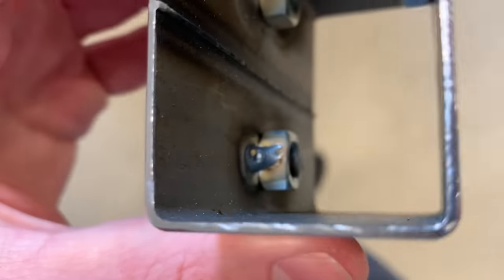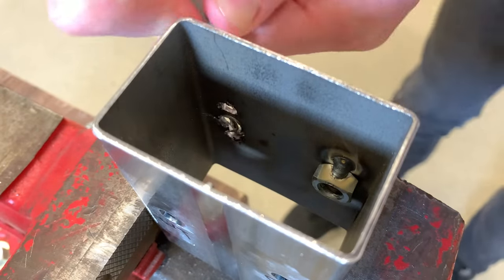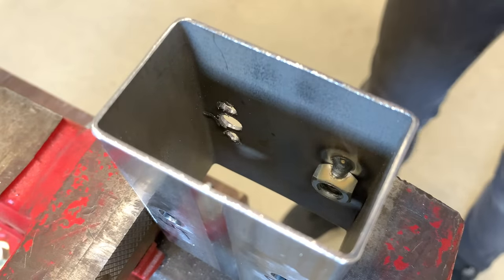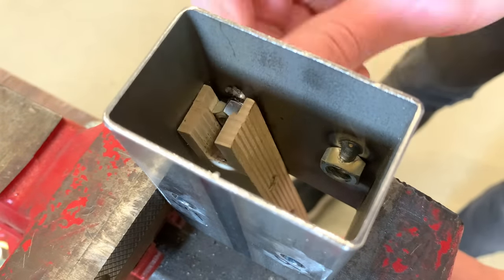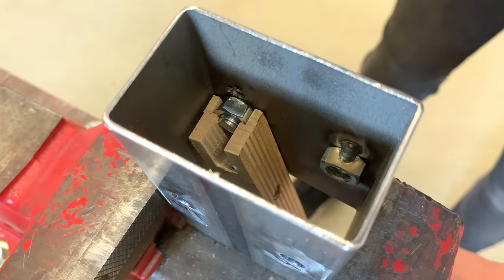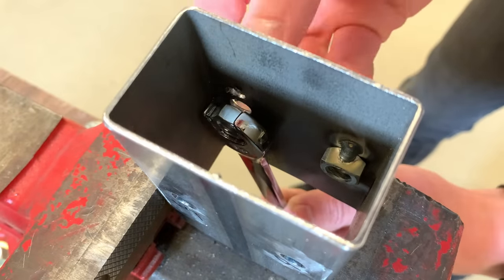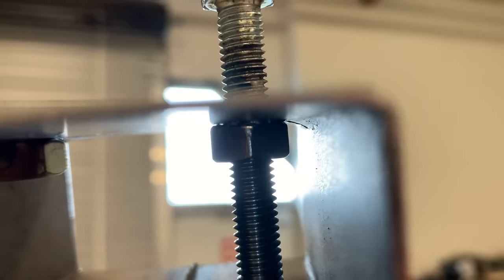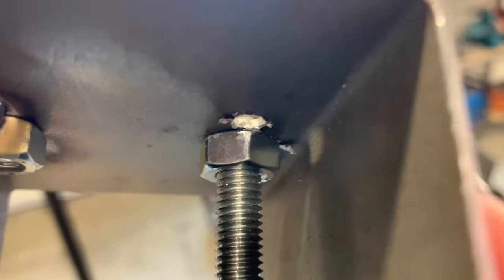Here's how those finished welds look from the inside. Now, let's talk about some different options and caveats. Since I mentioned it earlier, let's talk about what you can do about those burrs on the inside. The first thing I'd recommend is to remove as much as you can — I'm doing this blind, not looking inside, so I don't know if I'm actually doing any good. Now looking inside, I can see I definitely didn't get it all, but I'll put the nut in there and then take a bolt and washer and put that in from the outside. I'm literally just going to tighten this bolt down and crush all of those burrs flat. This doesn't remove the burrs, it just smashes them flat, and I personally think that's good enough.